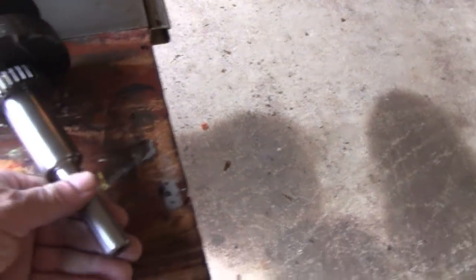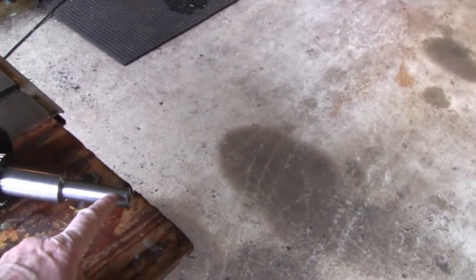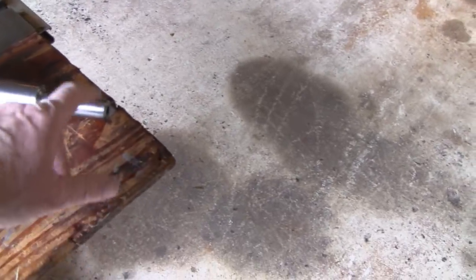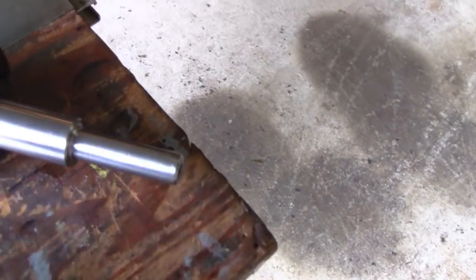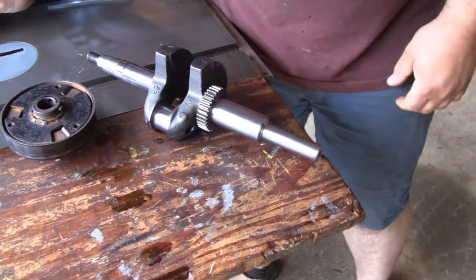I think we should anneal that, Mike, because when I was cutting this, it actually chipped my... There is, because when Bill did this, it was like 60 degrees out that day. We were letting it cool by itself, but every once in a while you get a breeze kicked up, and that's probably what hardened it. I mean, just to save the cutter, it ain't going to take much just to anneal it. All right. Yeah, I definitely don't want to mess that cutter up.